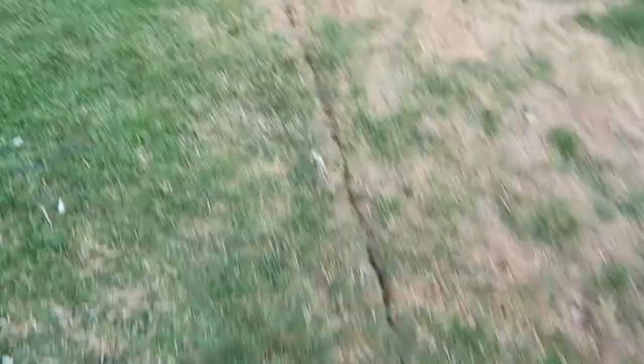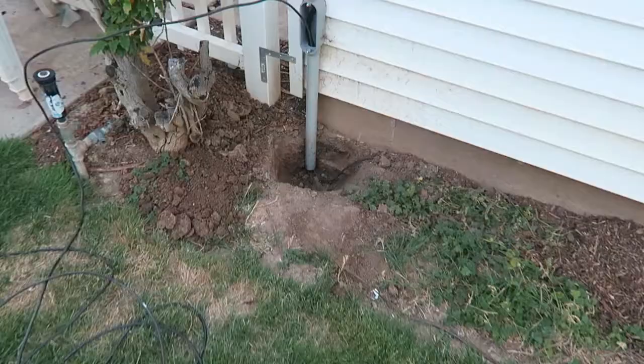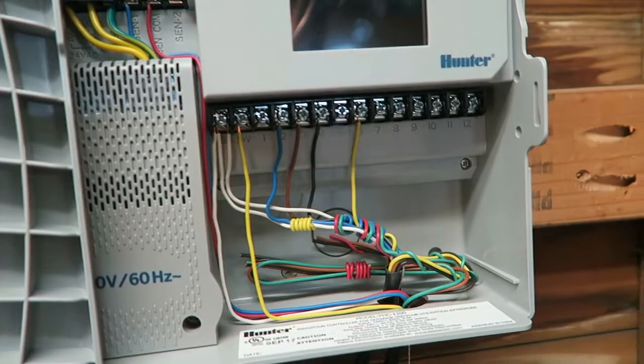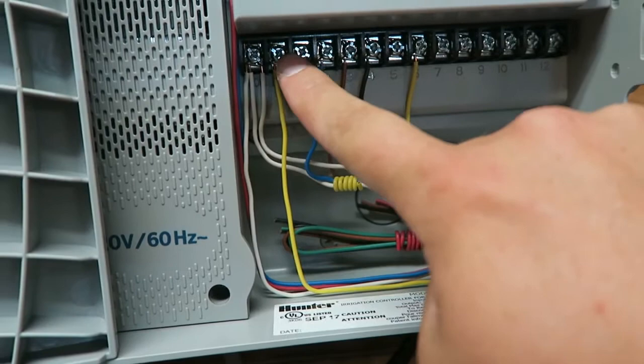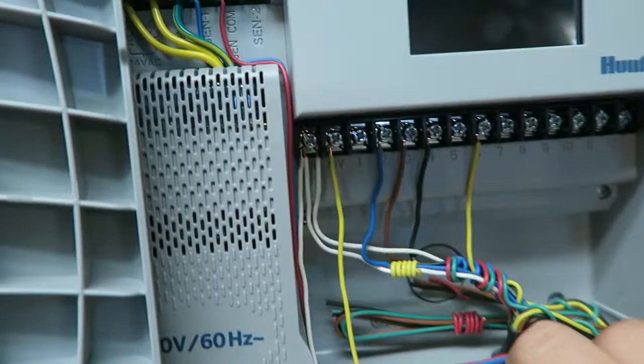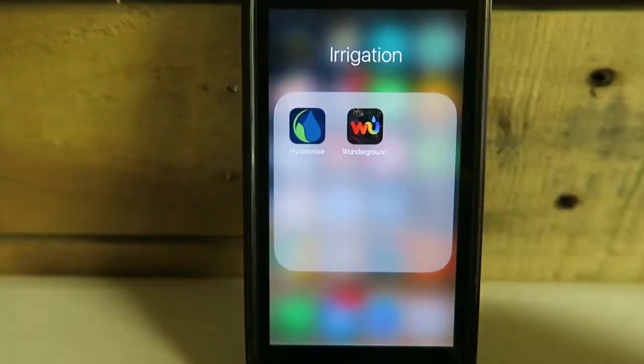Here's the first box, second box wired up the other night. I just now ran this wire underneath the mulch. I've got this wire pulled up through this conduit and now I need to push it through into the garage. I've got this all wired up — I added a new common wire, new white one here. It says MV — master valve — the yellow wire to that new valve. Up top I've got these two wires: the sensor common, where I connected red to white, and then the blue on sensor one.